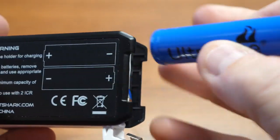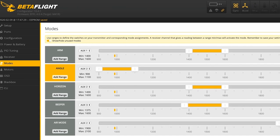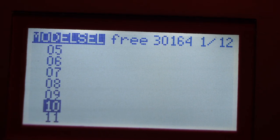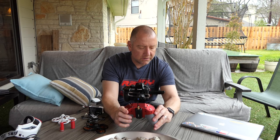That was one thing that was kind of a little bit of a learning curve. But the bigger thing was using Betaflight and also setting up your switches in your remote control. I'm going to show you how to do that right now. The first thing you want to do is go ahead and turn on your remote. Before you even turn on the power of your drone, you're going to turn on your remote. Then push the button in and say create model.